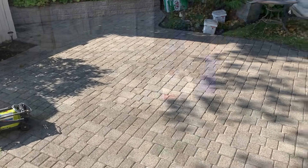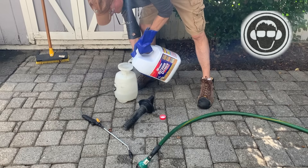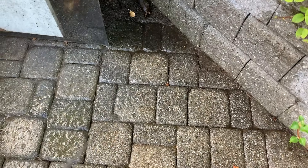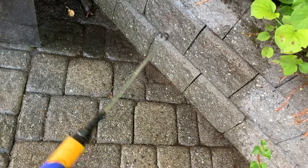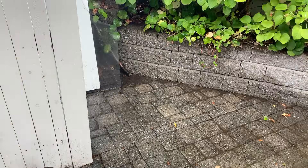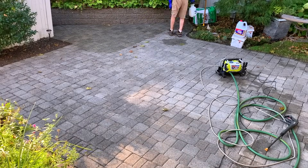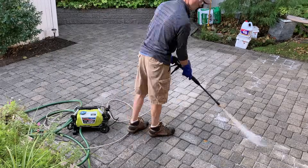To deep clean the pavers and kill moss and weeds, I used 30 Second Cleaner. It's basically industrial strength bleach, which meant safety equipment is required. It gets mixed with water at a ratio of one part water to one part 30 Second Cleaner and should be applied with a pump sprayer. As with any cleaner, you'll want to test it in an inconspicuous area first. 30 Second Cleaner takes longer than the name implies when cleaning masonry — you actually have to put it down and wait 15 minutes. Once that was done, I rinsed it off with a garden hose, blew away the water, and scrubbed with a deck brush, although the deck brush really wasn't necessary. I applied it in sections using a pump sprayer, and while one section soaked, I applied it to another section. Then I went back and rinsed the first section using a rinse nozzle on the power washer, so on and so forth.